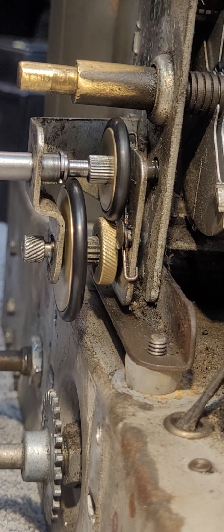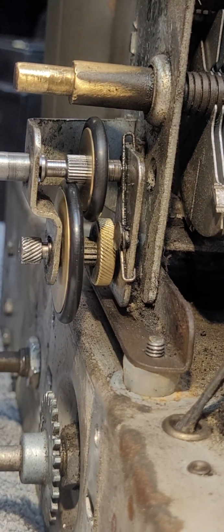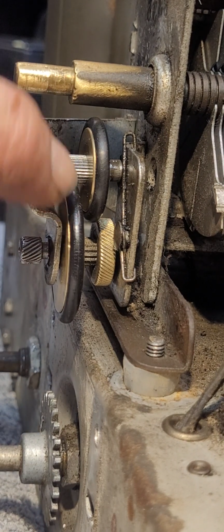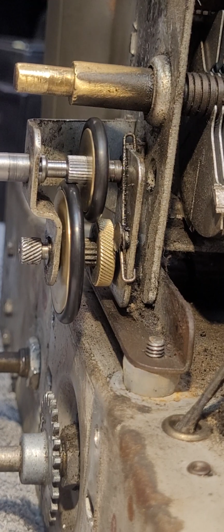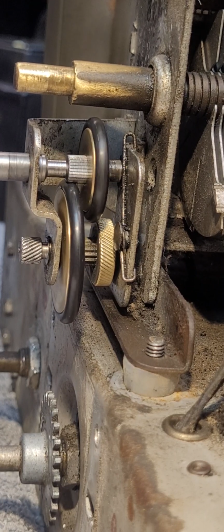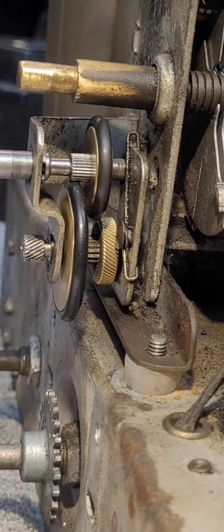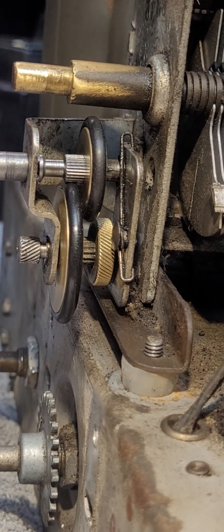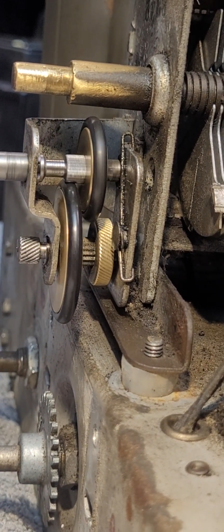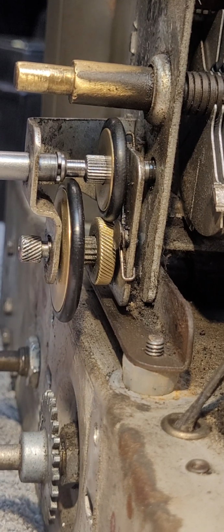So anyway, in, the large wheels to the rear are engaged. Here is forward, and the small wheel up top here is engaged to here. So it just merely changes the turn ratio of one gear to another on one simple shaft and one simple movement, in and out. Rather neat design. Like I say, once again, kudos to Philco. It works very, very well.